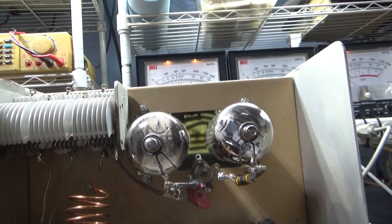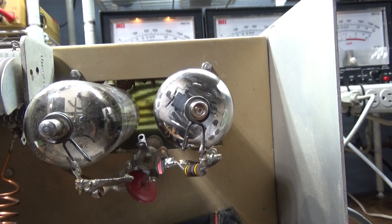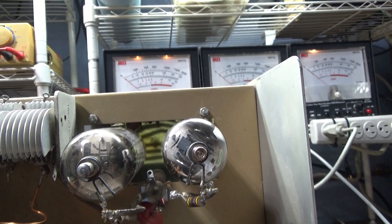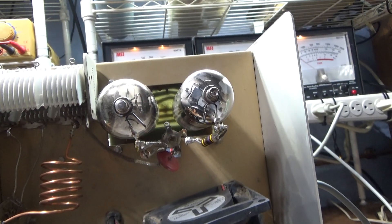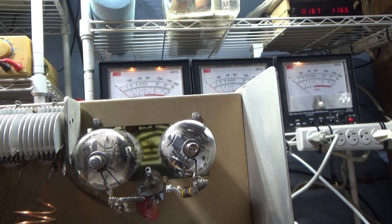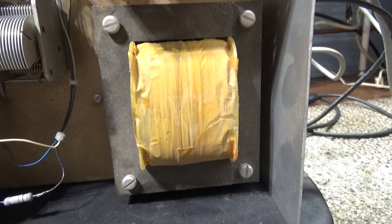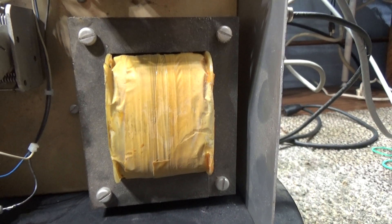This is the top side of it. When I got the amp, it was blowing fuses, and we found that the bias was bad. The tubes would run full bore with no bias, doing like 200 watts out until it popped a fuse. By the way, it had a 15-amp fuse in it.